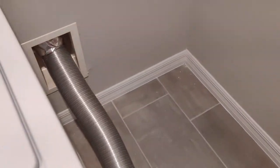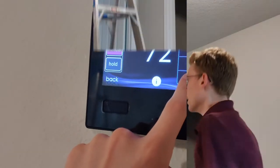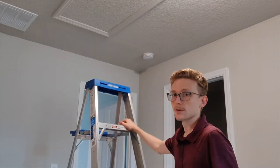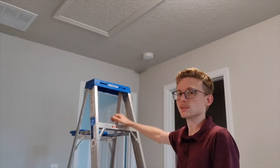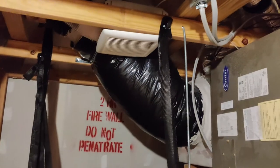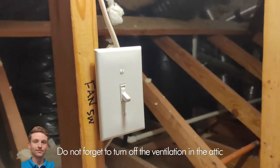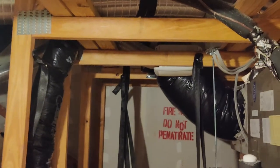Also need to make sure your dryer is off — it probably already is, but if not, make sure it is. This home has an exhaust ventilation system located in the attic, so that is going off. Otherwise I'm going to get a slightly better blower door result because it won't account for the amount of air being thrown out by that fan.